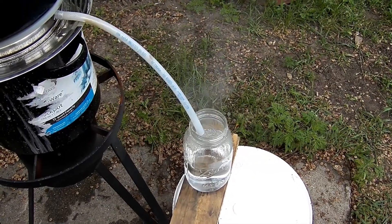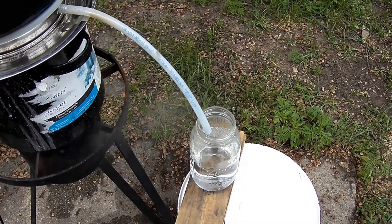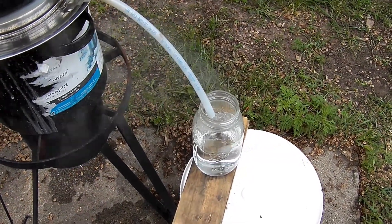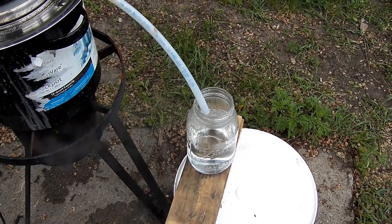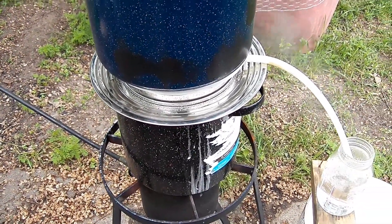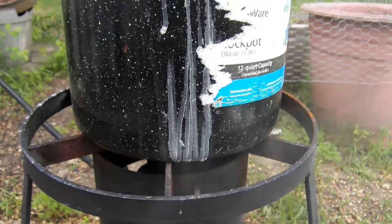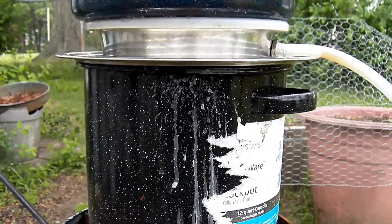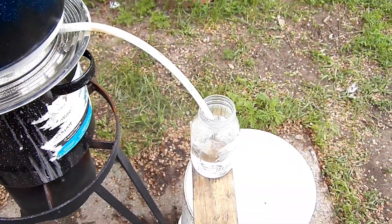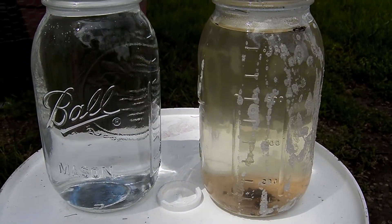Some RO systems are a little better depending on how they adjust pressures, but you're never going to have zero TDS water with a reverse osmosis desalinator — it's just impossible. With distillation we'll get pretty close to zero. Just wanted to show everybody that desalinating salt water is definitely possible. You can see the salt that has dripped off our pot and hardened on the outside — just from condensation dripping around the edge. Nothing really to worry about too much, because our water production is still high even with a hot condenser pot.